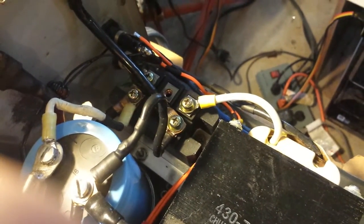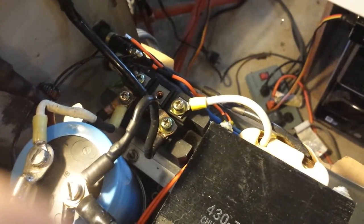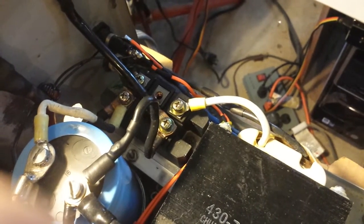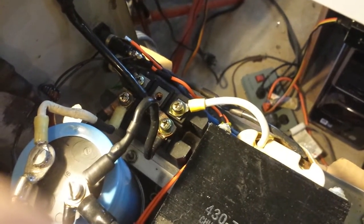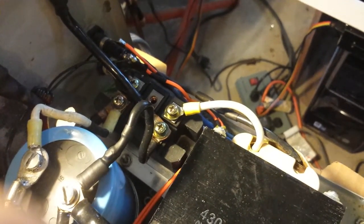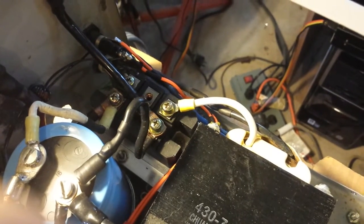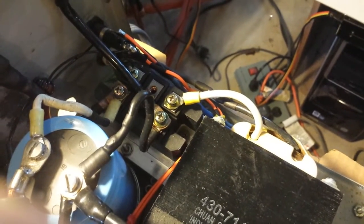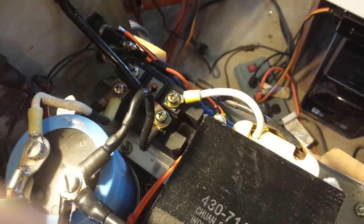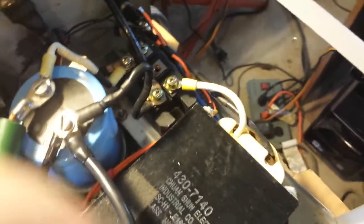I know a fella that's been using them for over 6 or 7 years now and has not had one fail on him yet. And I'm not kidding. And this guy uses them a lot. He builds a lot of 1,000 amp, 800 amp, 600 amp power supplies using these boogers, man. A lot less wires when you're building a 400, 500, 600 amp power supply. Instead of 64 wires, you can break it down to 16. Makes everything neater.